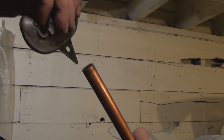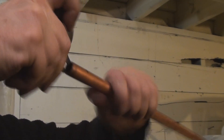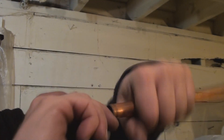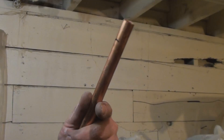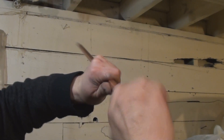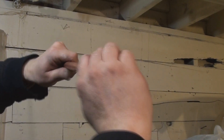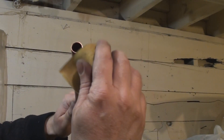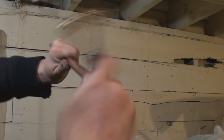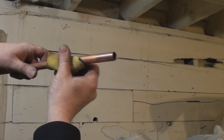After you've cut it, you want to ream the burrs out of the end — that's what that little triangle sticking out of your pipe cutter is for, to ream the burrs out. Make sure it's nice and smooth and clean. I'll just clean up the end with some sandpaper. Nice and clean and ready to go into those SharkBites.